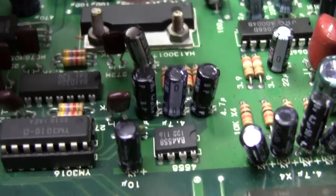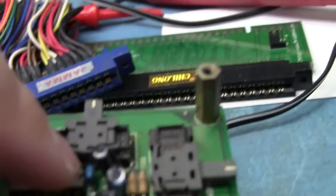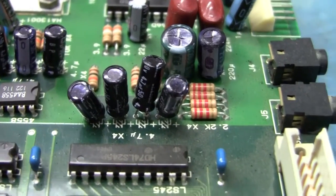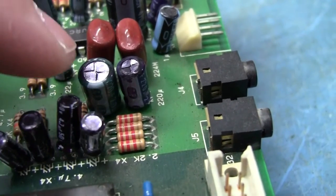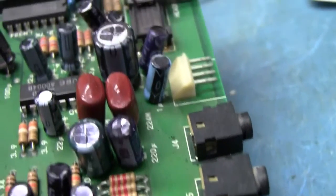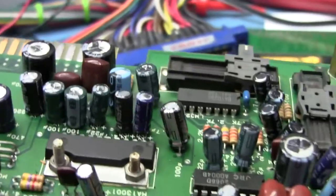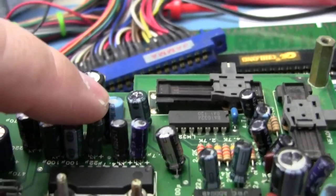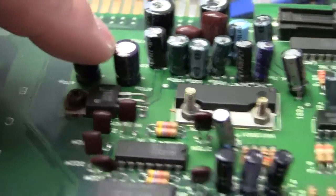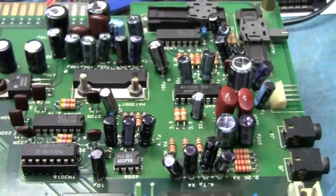Looks like they did three, four, five — and then six, seven, eight, nine — all four of those. And they used mismatched capacitors. That's not bulge; they just put marker over it so it shines and makes it look like it's bulging. Two different size capacitors: 25-volt capacitors — huge — where they should have been 16-volt. And they've used some really strange ones: Zycon, Nichicon, but then Rubicon over here, and one called Surge on the 1 microfarad. Just capacitors that I would avoid at all costs.